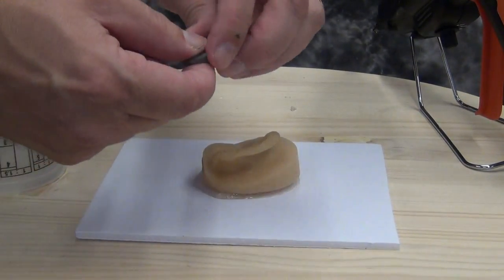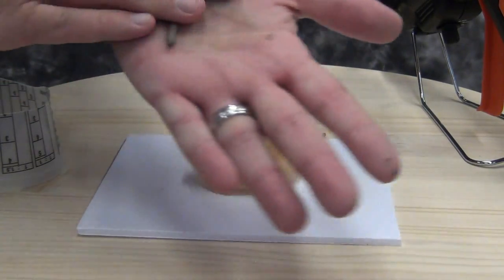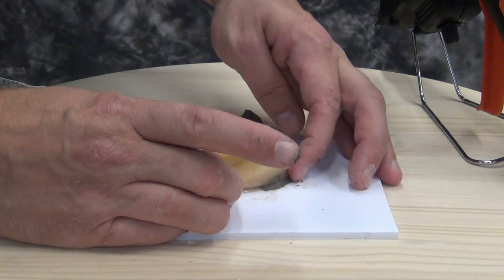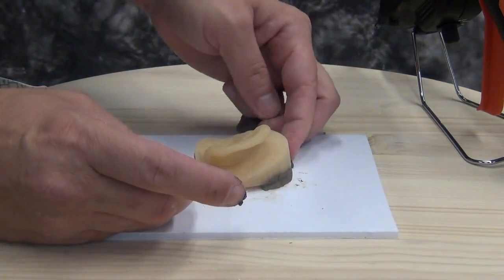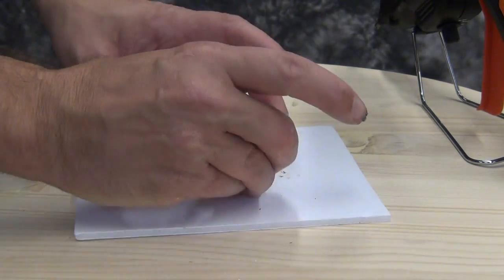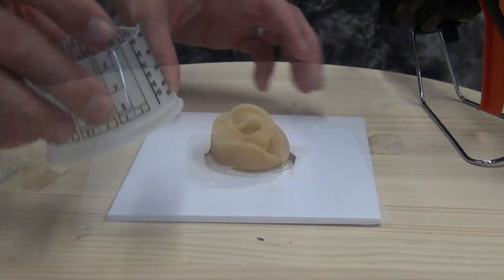Make sure you take that into account if you're molding really large pieces — it may take over a week to shrink down completely. Here we're rolling out some water-based clay to seal where the ear meets the baseboard and clean up the edge of our mold so our rubber doesn't get underneath our cast. This is a quick and dirty mold because most of the time when you're molding a Shrink-It part it will be to make a clay pattern or something later on — usually this is an intermediate step to a bigger process.